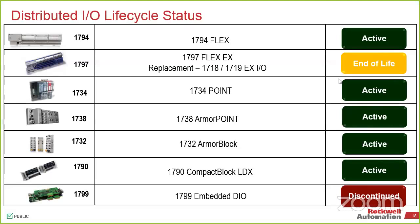So at that point, what we'll start seeing is if there's a need for PRP, which is that parallel redundancy side of it, multiple I/O points, because the existing Flex can only do 8 cards, the new Flex can do up to 16. If you have a simplex process system right now, we can talk about architectures, and it might be beneficial to go the L8 route. There are some functional benefits of going with an L8, but because it doesn't support redundancy yet, it pigeonholes us a lot. So the L7 is still our main process go-to. But if you have a system that doesn't have those limitations, doesn't require a phase manager and a couple other things, we'll end up looking at it. So, it just depends.